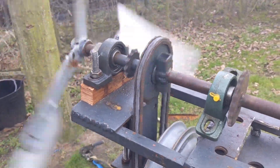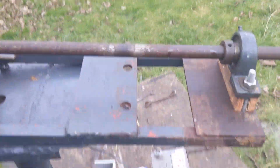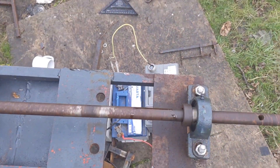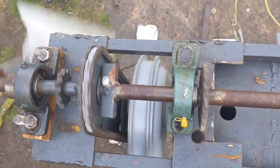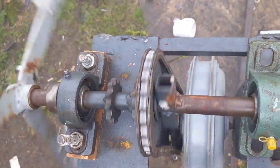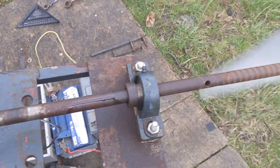The shaft at the moment needs to be realigned, the bearings need to be moved. It's not quite perfect for this one, which is why we get a bit of wobble. That's why I'm going to spend some time making sure it's perfect before it goes up.